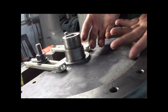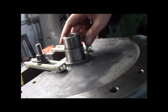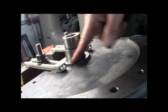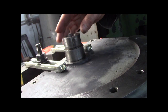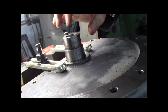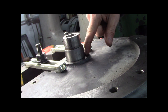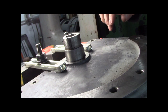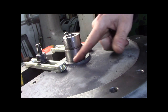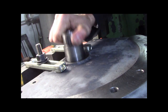And like I said, in that bore, there is a slot for lubrication. And I don't know why you'd ever do lubricating a shifter hole that never really moves or spins. So that's what I wanted to do. Put that O-ring in there. And the other job will be lathe work to put the groove in the shaft. So, successful setup on the SIP. How's that? There you go. I should have had the lamp on. But that's good. Let me pull this out.